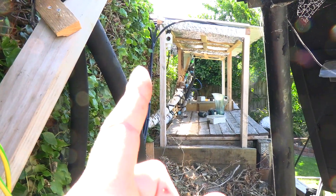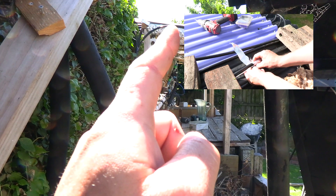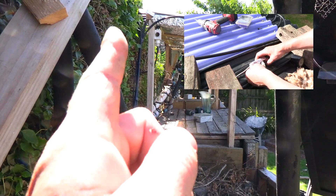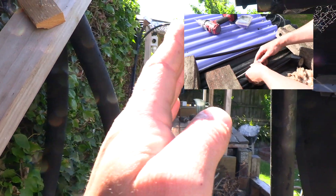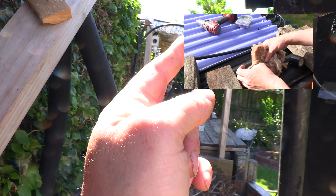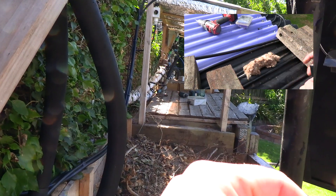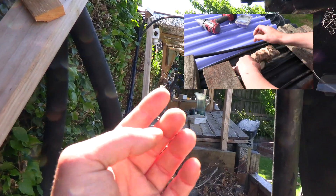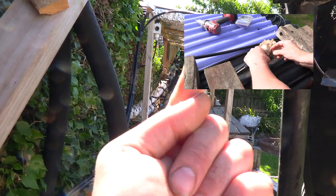At the very end here where the outgoing water is, I put the thermostat there so that the water goes in and goes through all the pipes through that collector. As the cooler water works its way through those pipes and starts to flow past the thermostat at the end, the temperature change is detected. When the temperature is low — detected here in the collector controls — it will switch off the water flow in there and switch back on the water flow in the original collector, and then that will allow that water to sit there in the sun and warm up.